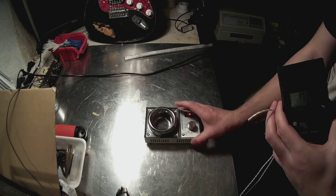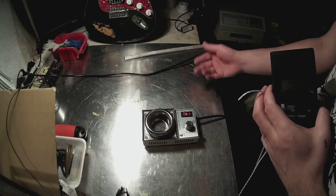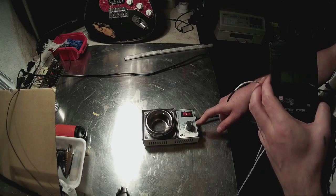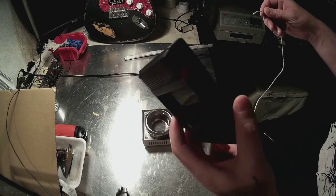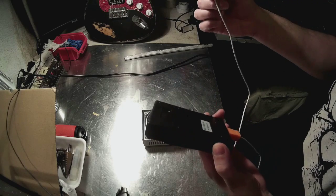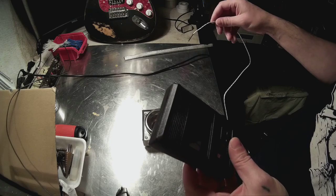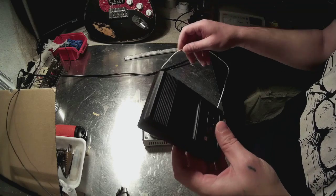So we are back. This is the solder pot that's preheating. It has one on-off button and a little potentiometer that sets the temperature approximately between 200 and 450 degrees Celsius. I just bought — as you've seen on Facebook — two thermometer modules with K-type thermocouples. Very handy, and for the price I paid they were almost free, around $7 to $14 each.